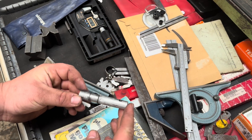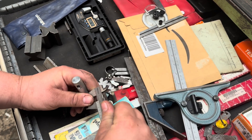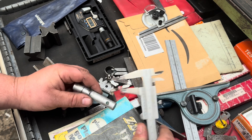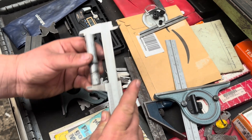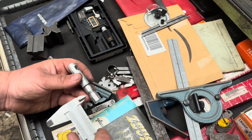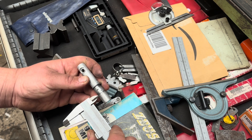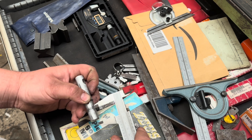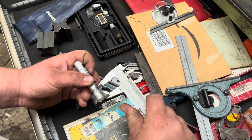The first job of course is to measure this pin - this is the simplest thing to make. Let's get some rough dimensions of what it's meant to be: 16mm OD, 90mm long, and then we've probably got a 1.2mm circlip groove roughly. We'll get the measurements for how far that is from the end - not very clear, I'm filming from the side, I apologise.